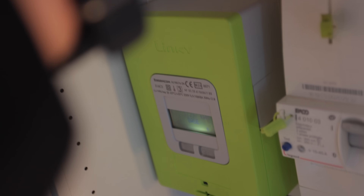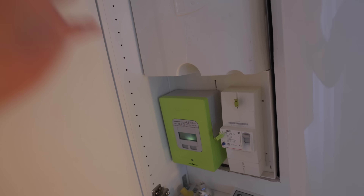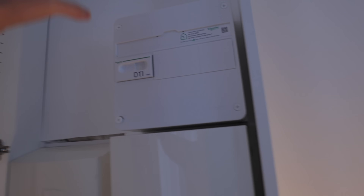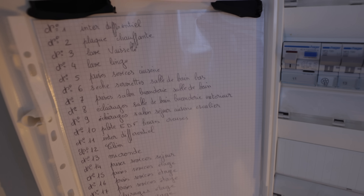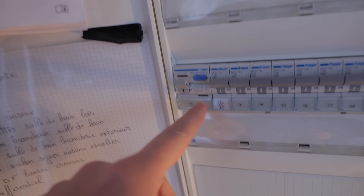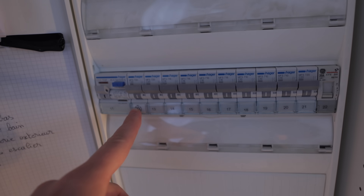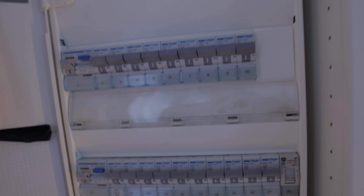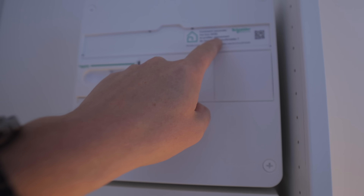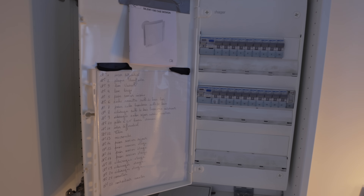What's under here I wonder? It needs a screw so we'll take that off in a minute. This is really clever — it's all one unit. Where do the cables come in the back? We'll carefully take the cover off and have a little look. In here we've got our circuits, very lovingly handwritten in very neat handwriting. The electrician who did this seems like they cared. All the breakers are numbered, which is really nice, and we've got multiple RCDs. This is a type A, and this is a type AC — interesting. Tell me in the comments what that means. Why are these circuits on a type A RCD and these ones on a type AC? What would you expect the circuits on here to be doing versus the circuits here? Up here we've got what looks like ADSL, and then it says DTI test — so what is behind that cover? Guesses in the comments below. Let's take the cover off and we'll do neat or not neat on my French consumer unit.